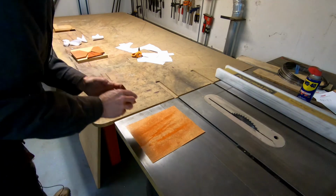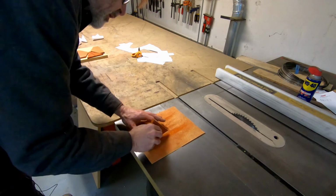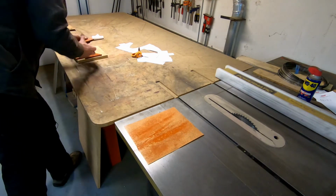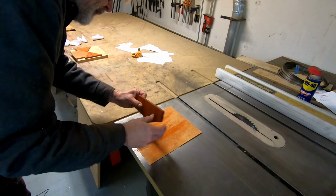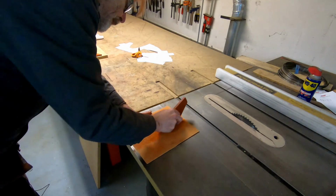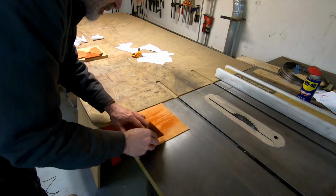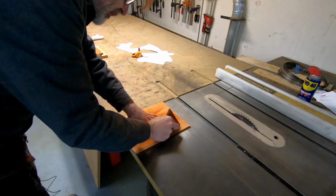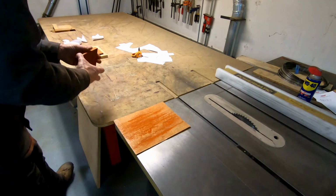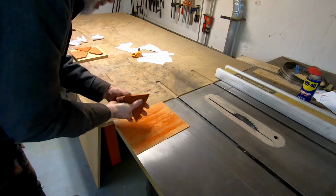that. This is just the finest of adjustment here. The piece is almost fit. Very close. But I can get them closer. The disc sander, compared to a belt sander, a disc sander can make a very, very flat result, but not perfect. Better than a belt sander, but even a disc sander, when you press a piece up against it, is good, but not perfect.